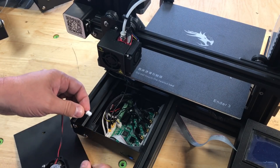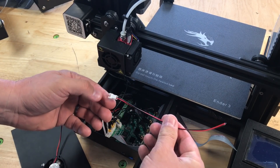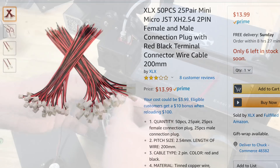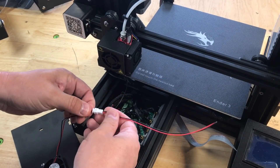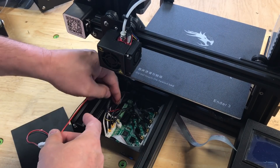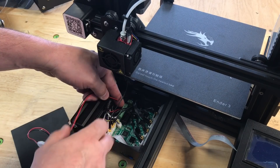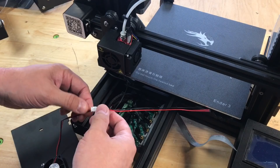What I'm going to do is pull out this connector and then add an extension like this — I found it on Amazon, bought a pack of 25, but all I need is one side to fix this. It plugs right into the fan connector and then I can take the other end and connect that direct to power. I'm going to use the same power pins that control the cooling of the hot end, so when the hot end is being cooled, so are the electronics.